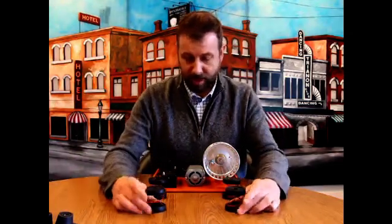That's when we move into something with greater deflection, which means greater isolation efficiency. We have these small springs here. The difference with springs compared to neoprene is they give you typically a higher deflection and greater isolation efficiency, but they also don't have any damping. What that means is they're not trying to stop the movement, so they move more freely — and their isolation efficiency, even if the spring had the same deflection as a neoprene mount, the spring isolator will outperform it. So we get our four springs here — now we're getting a little bit more serious and we're actually solving our problem.